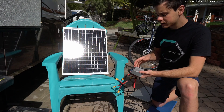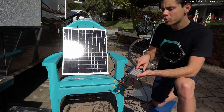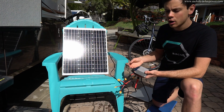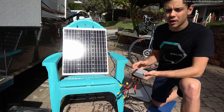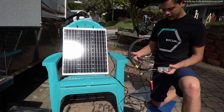What I love about this system is if you have a small DC fan in your roof, you could power it with a small solar panel and a converter. So whenever it's sunny or warm, the fan will always be on. But if it's cold and dark, the fan will have no power from the solar panel and will turn itself off. So it's like a self-modulating system. This thing's still producing great power — this is incredible.